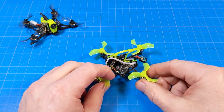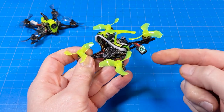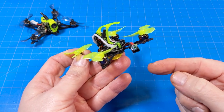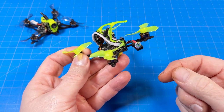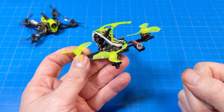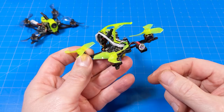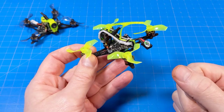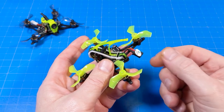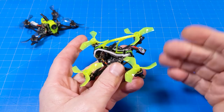I think this connector issue will have to be corrected for it to really change the hobby toward wider adoption. GNB27 has gotten a lot of attention from manufacturers because they can get the connector, get the performance improvement, and it doesn't cost them a lot. BetaFPV also has their BT20, which a lot of people really love, but other quads aren't using it because BetaFPV seems to be charging a premium. My understanding is GNB originally came to BetaFPV wanting to make batteries with the BT20, but they couldn't work out a feasible deal, so GNB made their own, fragmenting the market a little more. Some people still prefer XT30, but that's a gram you don't need.